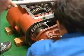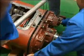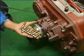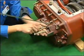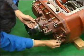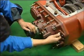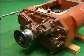Lift up the rear cover assembly of the auxiliary case. First install part of the assembly and adjust the space between the rear cover and main case housing, then push it in but do not knock. Set bolts around the rear cover — there are three types of bolts. The four longer ones are set at the convex part of the cover, the shortest one is set at the right side of the outer cylinder, and the remaining ones are the same. Screw down all bolts around the rear cover, leaving two bolts loose which will be used to pin up the wing pipe.